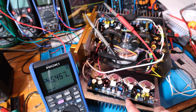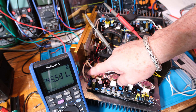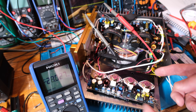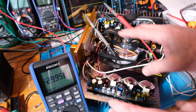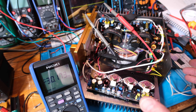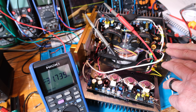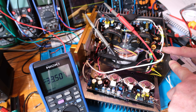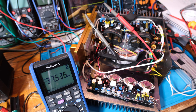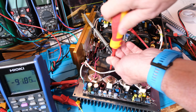Now I need to bolt this thing back down, straighten out the wiring, disconnect the bench power supply wiring, and wire it to the actual transformer winding. I'll put it all together and test it again — look at the output, run up some power, make sure everything's clean, and confirm there's no 60 Hz buzz. When I power it up again I'll use the variac to bring up the AC slowly so I can monitor the voltage. I also re-greased it and put fresh thermal grease on the heat sink after taking it apart a few times.